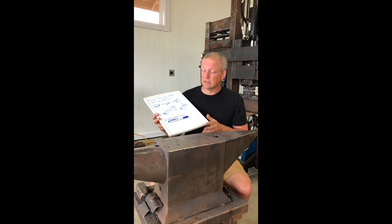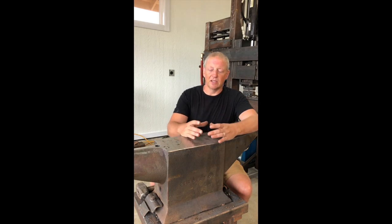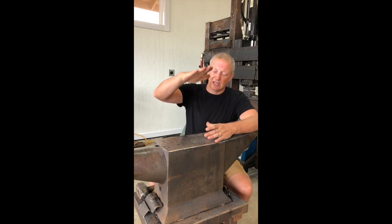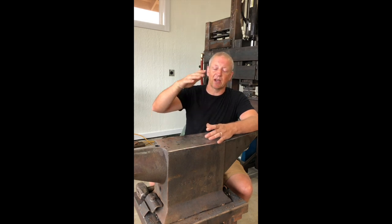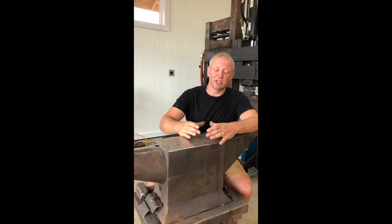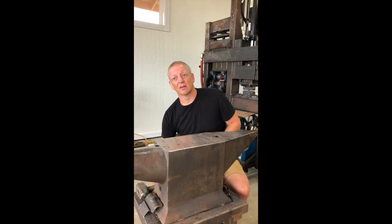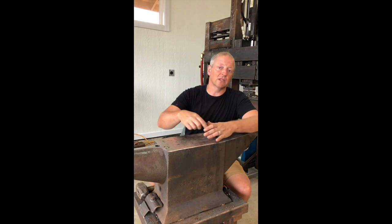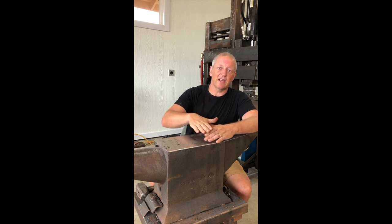So that was the first step, having the ingot face down. Whether you're working by hand, under the press, or with a power hammer, it's kind of the same thing. You're going to forge down through the top of that dome to create a disc. If you imagine that it is porous mostly in the center, which was the last area to solidify, forging in this fashion compacts that central area very effectively.